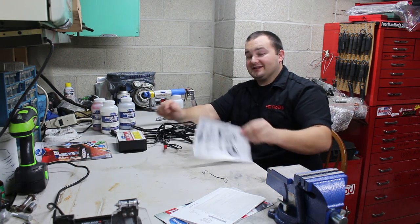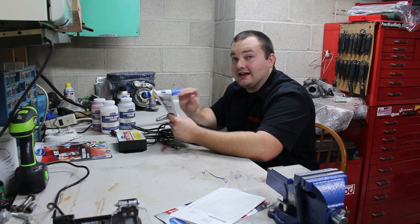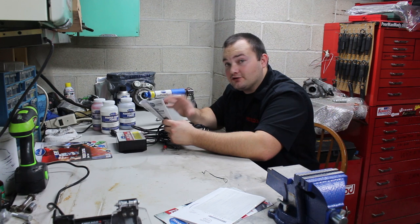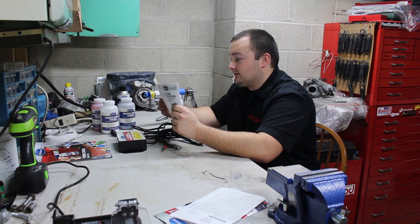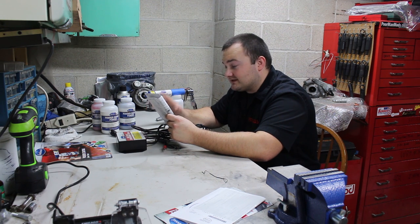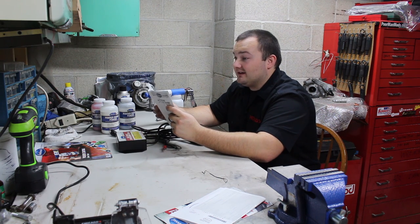This kit is the real deal and it's not that expensive. It's important to note that when you get something to bake the coated parts, it cannot be gas or have any open flame — it has to be electric, because a flame could really damage the object you're coating. It also cannot be the oven you cook food with; it has to be a spare oven. Another benefit over a paint gun: when you're done, all you do is spray air through it to clean it out. No chemicals, no soaking — just blow air through it and sweep up the excess powder. No overspray, no taping anything off.